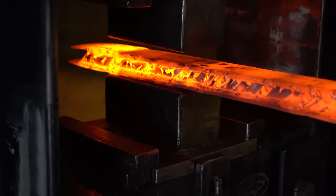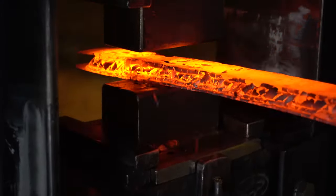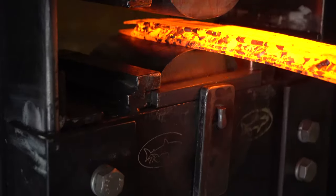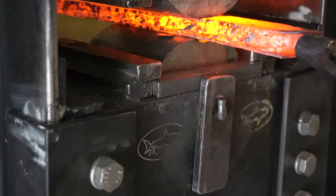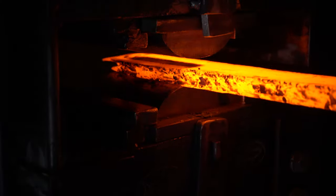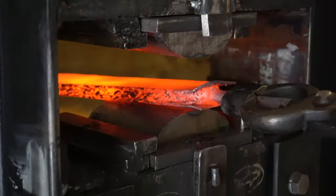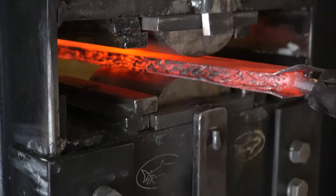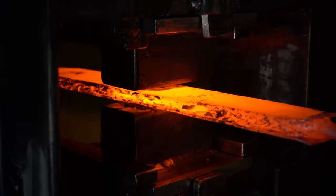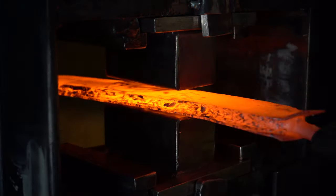This is a really important forge weld, so I want to make sure I get this one done perfectly — I want to get it really hot. It doesn't look like it on camera, but this one is really, really hot. After setting the welds, I noticed my billet was getting pretty long and I didn't really need that, so I started putting the fullering dies sideways to get some width out of it. Now I'm pressing down any peaks and valleys caused by the fullering dies and then doing a final flattening to have a nice solid billet to start with.